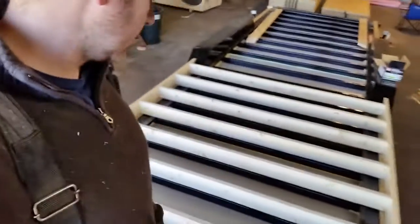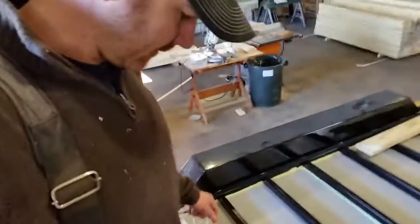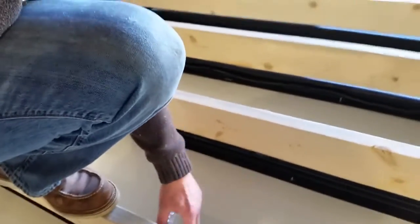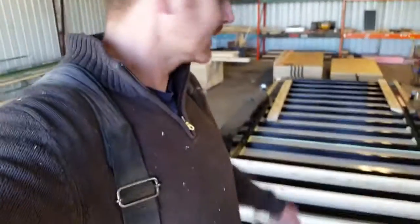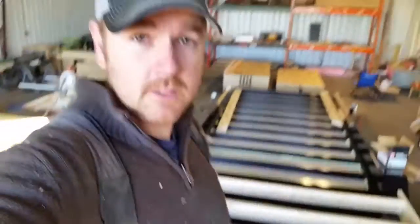That finished up. There's the front side of the floor. All of the floor joists run along the frame members of the trailer, so that's all gonna sit really well. You can get an idea now of how the spray foam is gonna come and fill up in here, fill down underneath this, and attach itself — so all of this is gonna be one continuous spray foam clump, and this floor will never move, never come off that trailer. It's permanently adhered. I'm gonna do the back and center sections, and this floor should be ready for spray foam tomorrow.